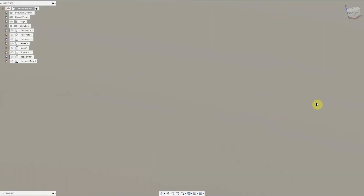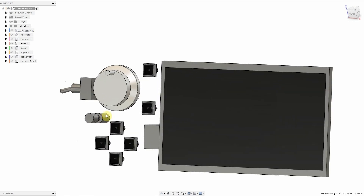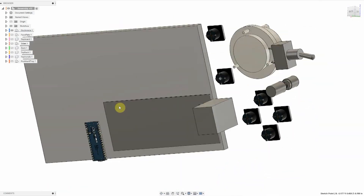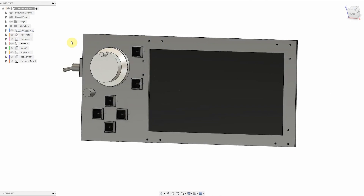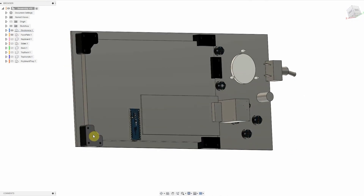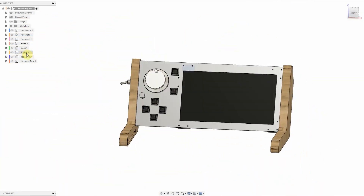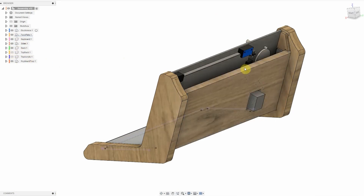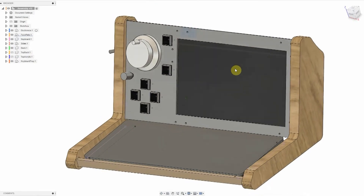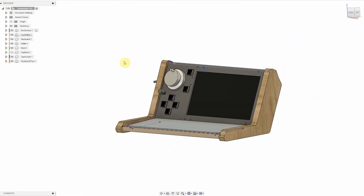As usual I start by placing all of my electronic components kind of where I want them and then I build around that. I've got the 10-inch touch screen, all the ITW switches, the rotary switch, the encoder, and the toggle switch to arm and disarm the system. On the back I've got the Nano IoT 33, which will attach to the back of the touch screen. To hold most of this in place I have a face plate made out of 3mm acrylic, and these black pieces are the 3D printed brackets that will hold the touch screen to the acrylic. The sides are going to be made out of oak, and the switch is kind of embedded into that. I also needed a keyboard tray made out of quarter-inch pieces of wood. To hold it all together I routed out channels for half-inch plywood and I'm going to screw that into the side instead of gluing it, so I can get it apart when I need to do maintenance. There's one more piece of acrylic at the top which has a little hole for the LED that will tell me if the system is armed or disarmed.